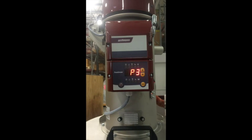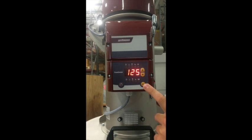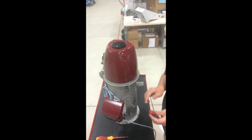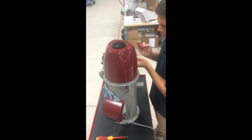After inspecting and/or changing the motor brushes, the operating hour counter must be set to zero. With newer units, this can be done by navigating to code menu 125 and pressing the on and off button. If done correctly, the letters CLR should be displayed on the front screen. With older units, you will need to refer to the operating hour counter instructions.